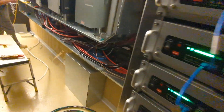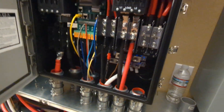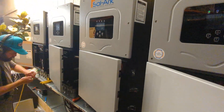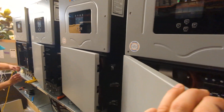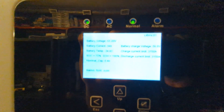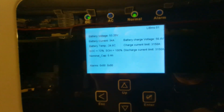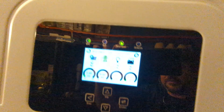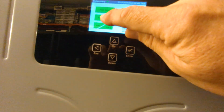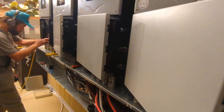This is the master — we're going to have four EMP-hardened 15k inverters. We had three and now we're in closed loop with the Pylontech battery. As you can tell by the screen, the closed loop is successful. The only thing I don't like is it doesn't populate the amp hours, so you have to do that manually — but that's okay. We're at a 5600 amp hour battery; it's a monster.